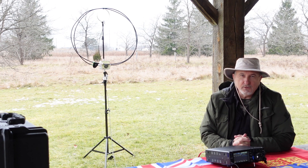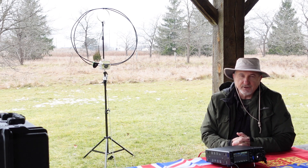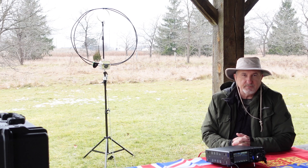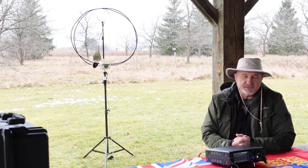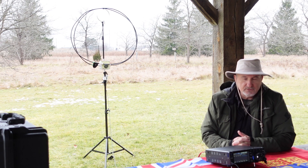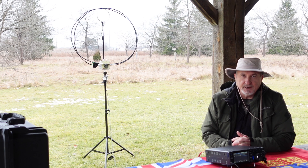When Tom and I came out here, the idea was to shoot a video talking about the ability of the Chameleon F-loop to operate on 40 meters. I did not anticipate the kind of struggles that Tom and I encountered. As a result, we burned up a lot of time troubleshooting — not necessarily a fault of the antenna, but there might be some. I don't know the history of this antenna as I bought it on the used marketplace. It could very well be a damaged capacitor. We did a lot of A/B testing between the aluminum loop and the coaxial loop, where we weren't able to make any headway at all with the aluminum loop, but were with the coaxial loop. I think if we'd started with the coaxial loop, we'd have been able to get on the air in time to actually do some operating.